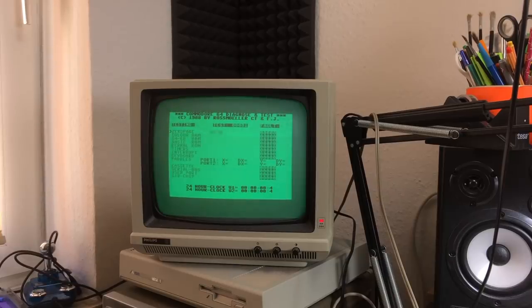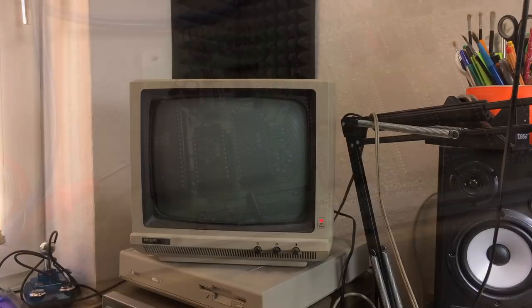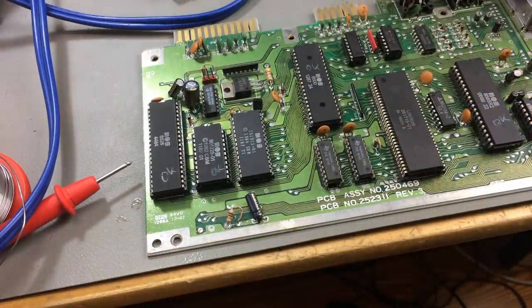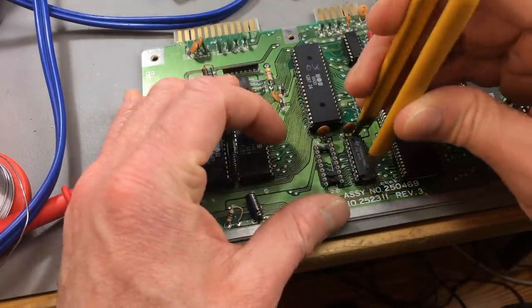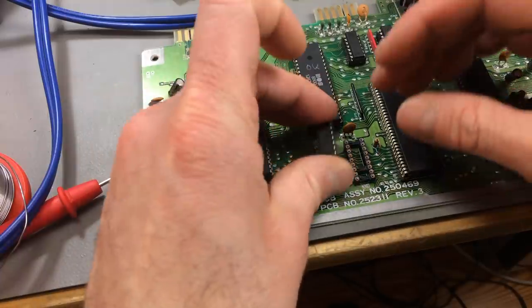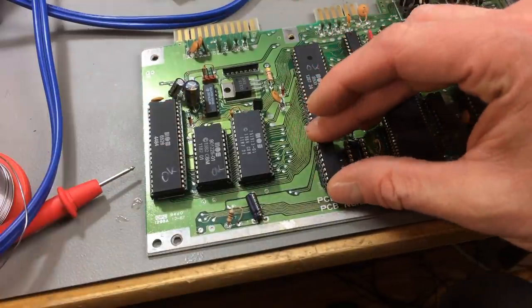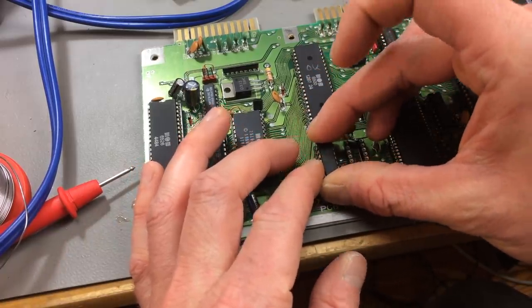Okay, the Dr. 64 cartridge works partially. It fails the RAM test, interestingly. So maybe we have some RAM problems too still. Man, but at least we're onto something. I think the RAM might be broken, so I'm going to replace the RAM again with the one that the person who worked on this before put in there. Let's see, maybe that helps.